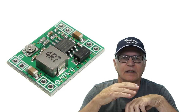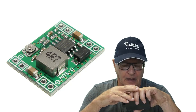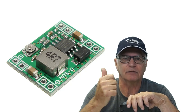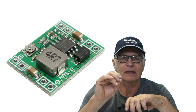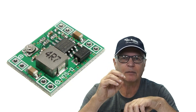We're going to use a DC to DC converter to bring it to 5 volts. I've chosen the MP1584EN to do this because of its small footprint and because I happen to have one, so it's well suited for this. I soldered some pins to that board so that it can sit on top of the headers.